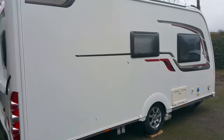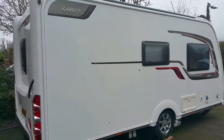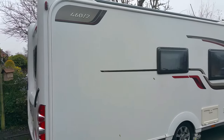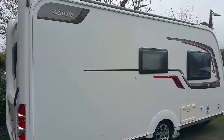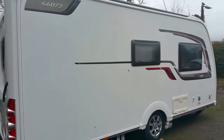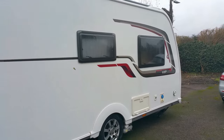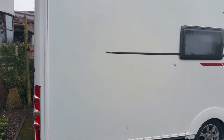The van is actually 5 years old and still has the original antifreeze in it, which is recommended to be replaced every 2 years. I'm not too concerned because the antifreeze protection levels are down to minus 30 degrees centigrade. So even if it has deteriorated somewhat, I'm personally still happy with that because we get nowhere near minus 30.